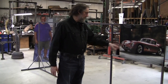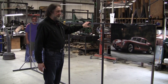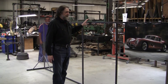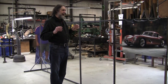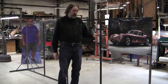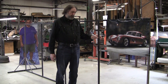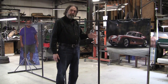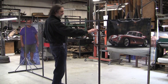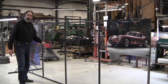I think this has probably got more overhang here. Why did we go to this height? We went to 60 inches tall because it's a couple inches taller than the GTV hood roof. We're using this as basically just a rudimentary starting point for the centerline. As we develop the profile, we'll chop this off because we don't want this on top — we want the true centerline, which is in the middle of this one-inch tube. We'll make little landings for the wire after we get them bent to our satisfaction. If this is the back of the car, this would be the roof. We'll be cutting it lower and lower depending on where the wire profile goes.